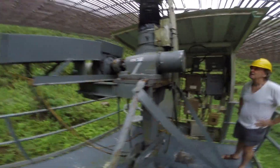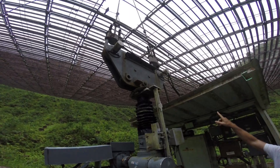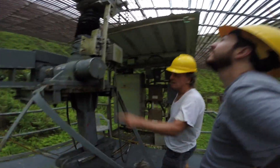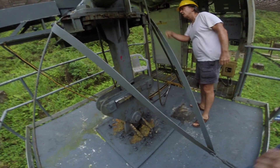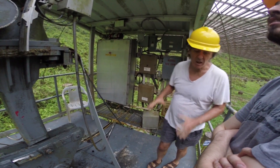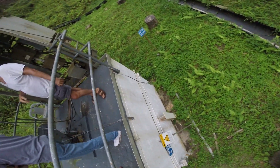This is the jack, and then there's the two cables, and that thing — the load cell — is actually just the pin. We've got some of the things here, and then there's the motors right there, and the encoder is over here on the other side. The electronic control is in this thing, and it's kind of closed up so it doesn't make RFI. The reason why this block is here is because all three of these are strong enough to actually pull the platform down.